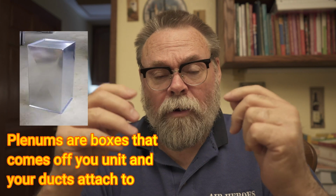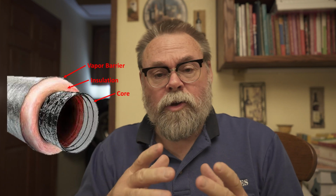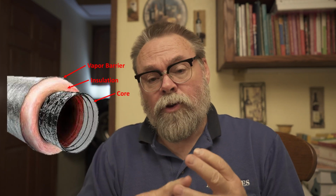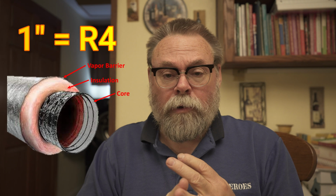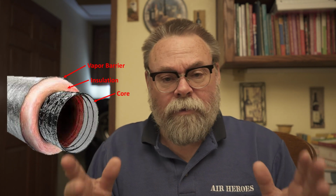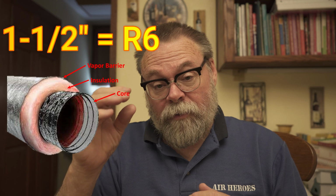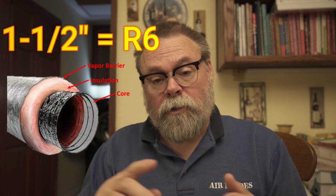Hi, Mitch Bailey here. I want to talk about duct insulation, specifically about some insulation on plenums and your ductwork. Now, all flex duct comes insulated. We buy it with 1 inch, 1.5 inch, or 2 inch. 1 inch insulation is R4.2. We can't use it anymore. That's probably what's been in your house for decades if you have existing flex duct. Today, code for residential is R6, which is 1.5 inches of insulation, and for commercial is R8.